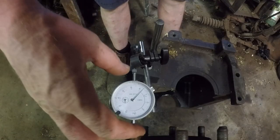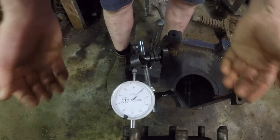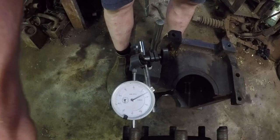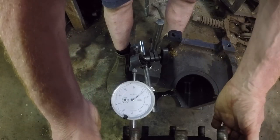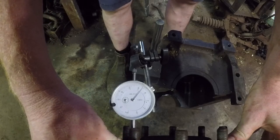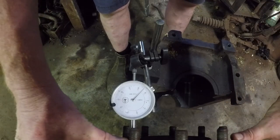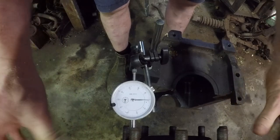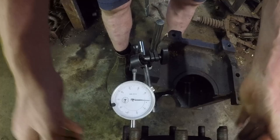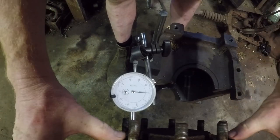Right — hopefully you can read the dial now. I've reset it to zero. In the workshop you'd catch hold of this and give it a good shake, but the dial indicator is sensitive enough to measure the actual rocking of the tractor very slightly, so we have to be careful. Pull it right out — set to zero — and gently push it in. We've got to about fifteen thousandths. We're aiming for ten; we've got fifteen. The shims are twenty thousandths, so we can't take any more out. We're going to leave it at fifteen — that's close enough. If you're doing this at home and you don't have a dial indicator, just listen for that little clunk: a little bit of movement — that's plenty.